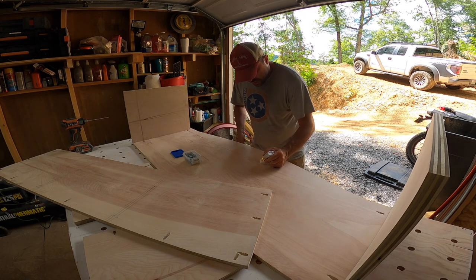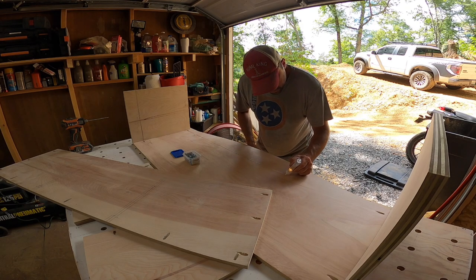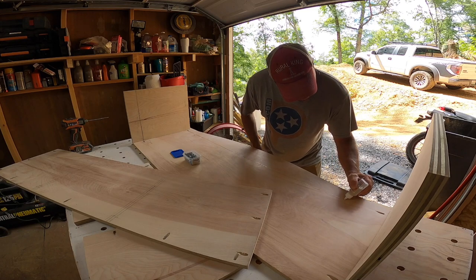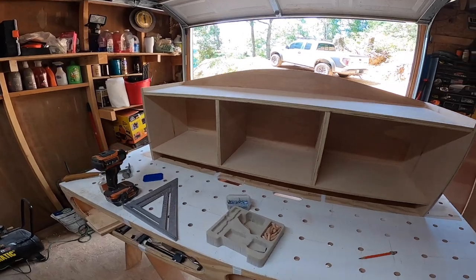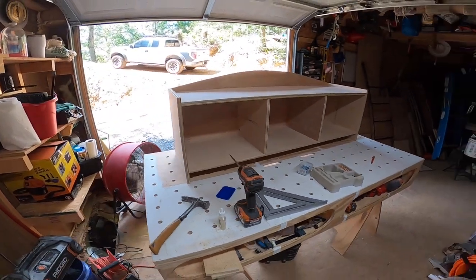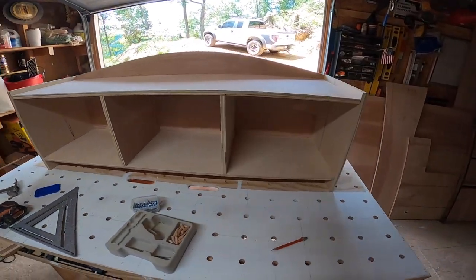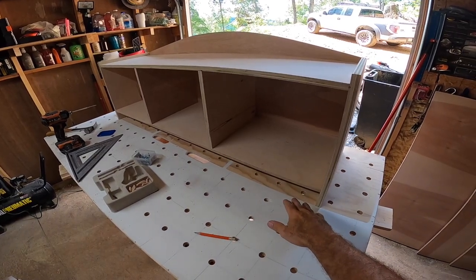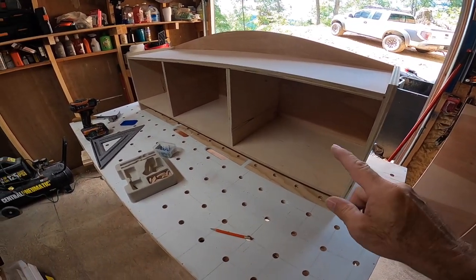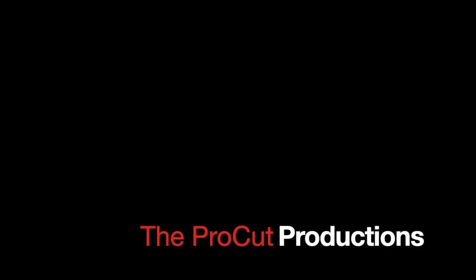Remember: the glue is your strength. The screws just hold the glue and hold the board in place while the glue is curing. And now we've got the main portion of our bench all built. There will be trim across the front and down the side, and then we've got three drawers to build — stay tuned.